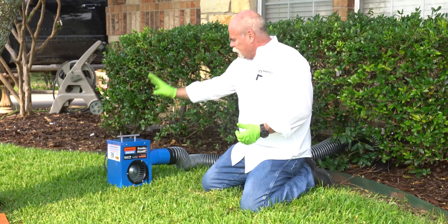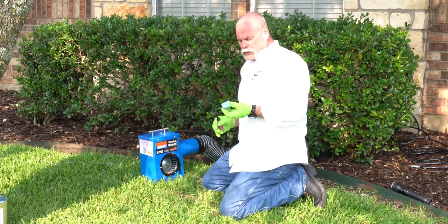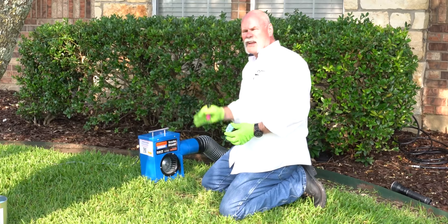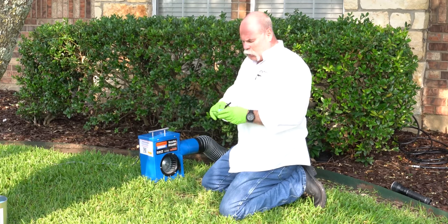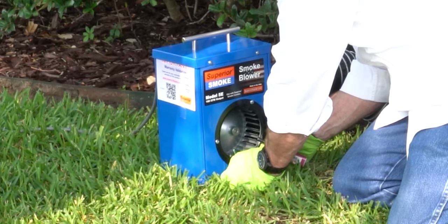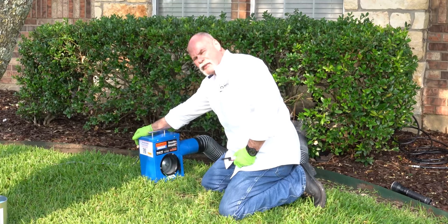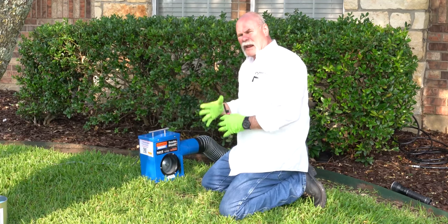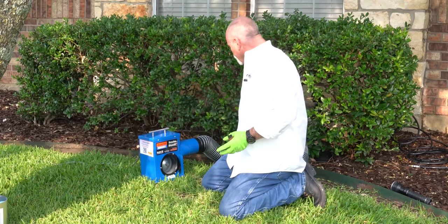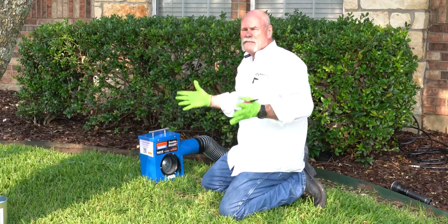So I've got the hose in the two-way clean-out, I've got the Superior Smoke machine here ready to roll. What we're using is a 1A smoke candle. The 1A smoke candle goes for 30 seconds, and it'll give me plenty of smoke to go through this. Now we could have gone with a 2B, which is a 60-second candle. What you want to do is put it right here in front of the fan so it comes out dead center in front of the squirrel cage. I'm going to bump the fan — as we see it's turning on, everything's good. I'm going to turn it back off, light the fuse, let the fuse burn down. Once the smoke starts coming out, I'll turn it back on. That way it draws the smoke into the squirrel cage, runs it through the hose, puts it in the system. We'll see it coming out the vents. I'll walk through the house just to make sure there's not any smoke inside. We're not expecting any problems here, but it's always nice to see.